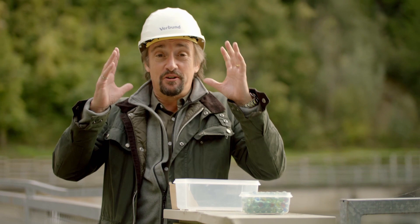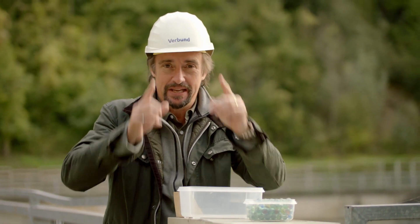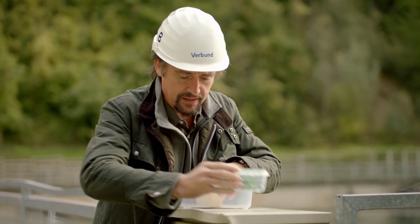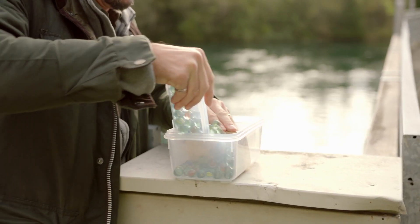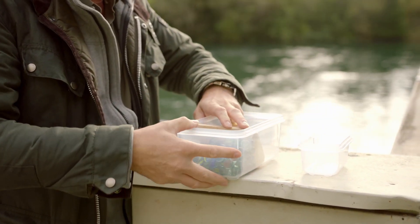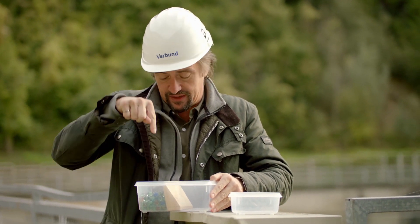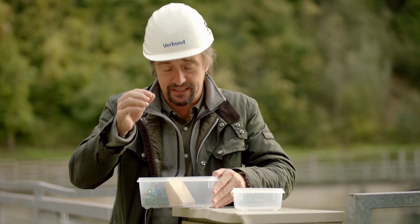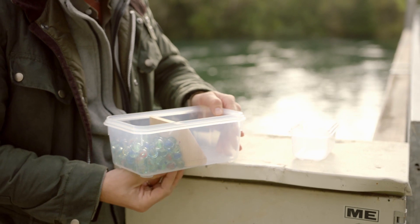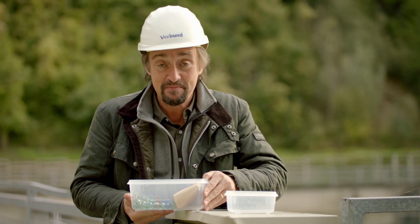Uplift pressure — the ability of water to lift millions of tonnes of dam off the ground and destabilise it. I have a demonstration here. This is my dam. This behind it is the reservoir, and these marbles are the water. So that is the dam holding back the water. There's immense pressure because of the height of that water. If just a little tiny bit of that water, as the dam heaves forwards under pressure, gets underneath the dam and pops up, it destabilises it. It's as simple as that.